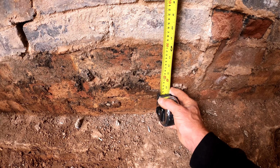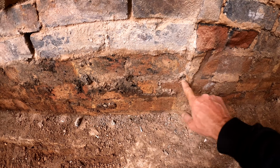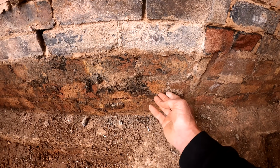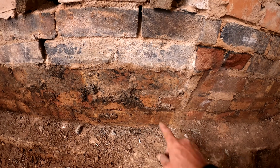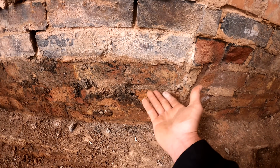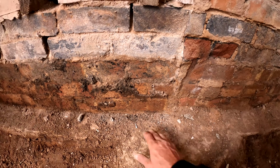So that's really cool. I know that I could, on this course here, take that or clean that away really nicely. And I'll take this course off as well. And then I can build a brick in there nicely to bring me up to the level. I'll probably end up, as I cut them out, just spinning the brick on a header. I can then bed it to the exact height I want. The other thing I am going to take advantage of is this footing.